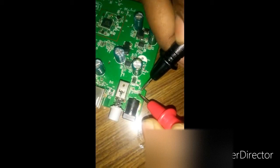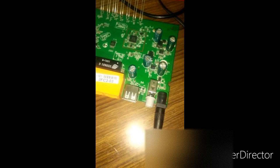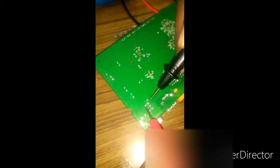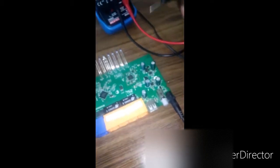Let me connect the voltage and check the switch. There's another problem you can identify with the switch. Let me check the connectivity of the switch - it seems to be fine. So the switch can also go faulty, but in this case what I figured out is that it's the fuse which is blown.